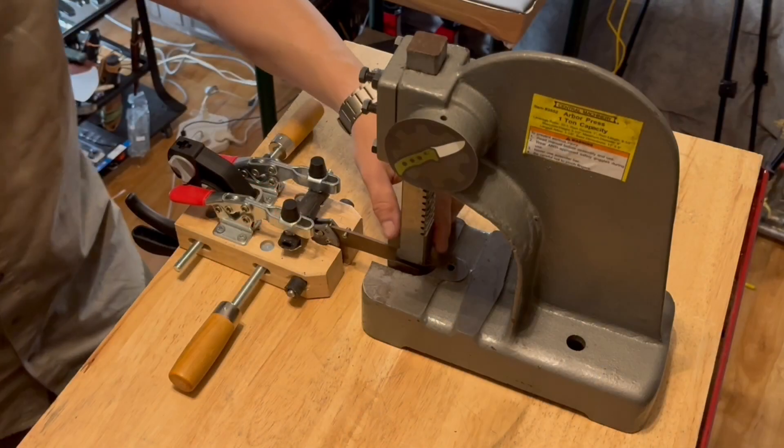This tester has an error of plus or minus 0.2 Rockwell hardness points, so technically it's slightly more accurate than floor models, because it relies on statistical analysis of a sample of five strikes — which yields a hardness of 58.5, plus or minus 0.2. What I'm peering at up close are the divots — you can see a metallic sheen where the probe struck. With trivial sandpaper, I removed the coating from both sides of the tang. This tester requires a certain thickness of material underneath the blade, so I'm adding an incompressible gel into the mix. That makes sure any cavities caused by imperfections in the blade's flatness are taken up by an incompressible fluid, making it essentially a solid block — a technique recommended by one of my subscribers.